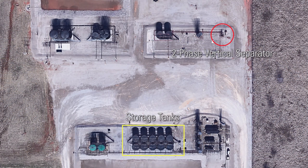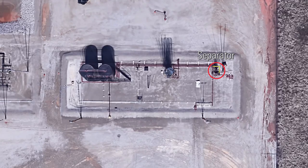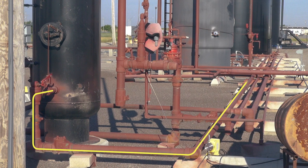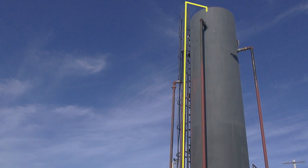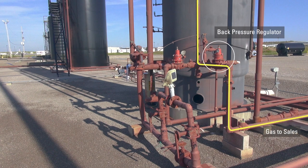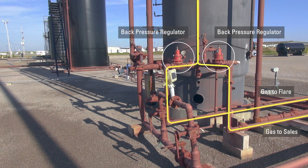This allows the oil, water, and any solids in the liquid to flow out of the pipe. This dump line could go directly to a storage tank, but in this case the producer needs to further process the emulsion to make it sellable. It is sent downstream for further processing at the next vessel, a heater-treater. The emulsion flows through the inlet on the top of the heater-treater where it hits a baffle. Natural gas still in the fluid begins to separate and flow out of the pipe at the top of the vessel, and the valves and piping will send the gas either to sales or flare.